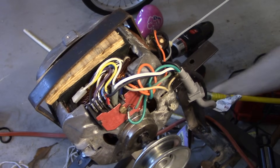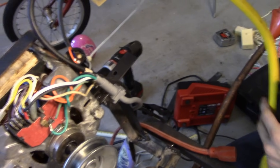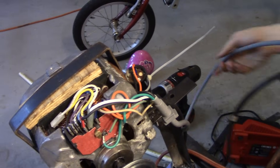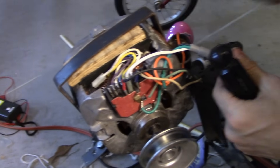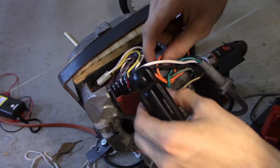I have mine wired through a three-way splitter for now, but you could also permanently solder something together. The gray wire comes from the splitter into the capacitor, and house black goes into the capacitor and into red on the motor.